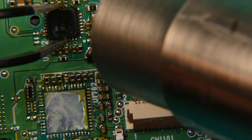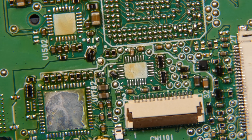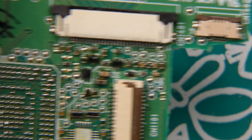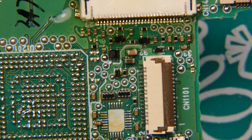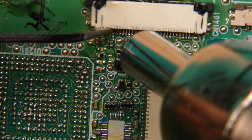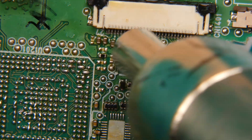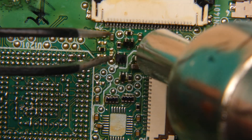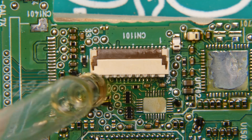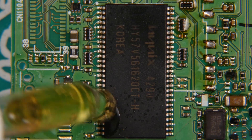If this was a repair attempt, that would not be good. I could realign all the components — it's doable, but it's additional unnecessary work. I'm really interested in salvaging all of these connectors, and in a moment I will try to remove one of the flat cable connectors. They are a bit tricky to remove. I use plenty of flux and I have to flow the solder from the small legs without damaging the plastic. Unfortunately the plastic gets slightly burned, but the upside is it's not bent, it's still in shape — just a small burn mark on top. For all the other connectors, I'm a bit more careful and also successful for the most part.